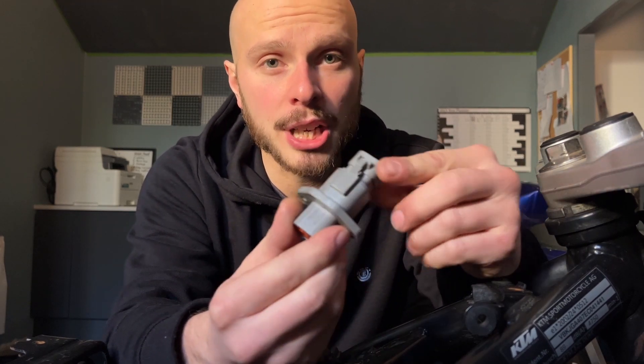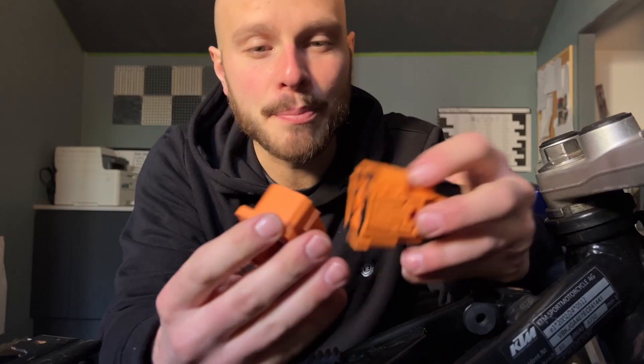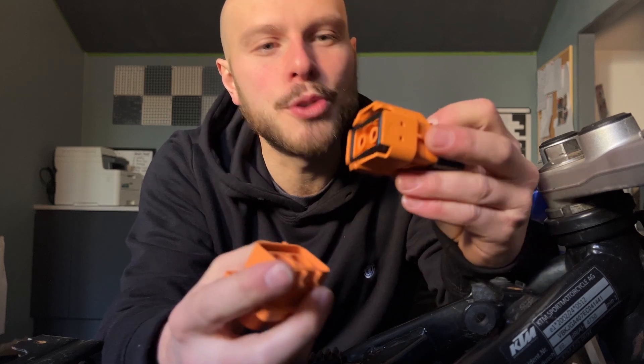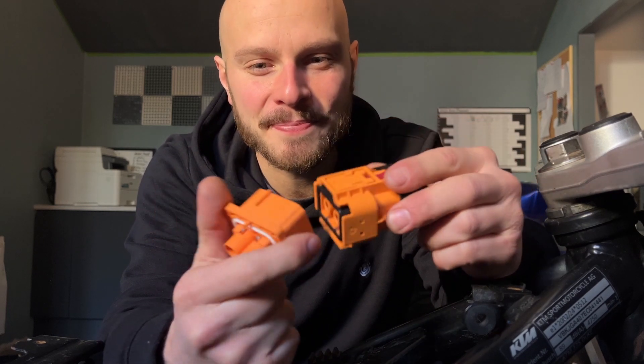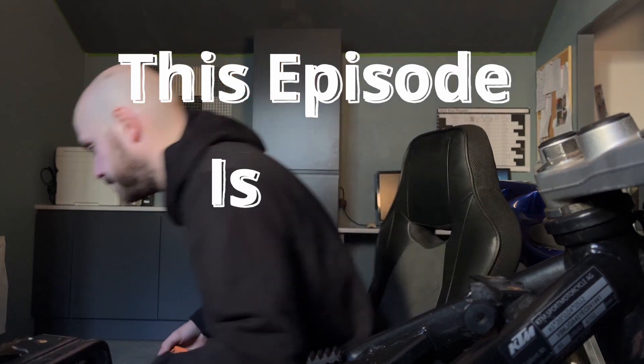Next up, I need to make the end for the box. This will be removable so if there are any repairs that need to be done I can do that. It's also going to house two multi-plugs: a large Deutsch connector for the charging circuit, and a proper electric vehicle Amphenol 120A connector for the main battery feed. I'm not certain how I'm going to make the end plate just yet — whether it'll be 3D printed or made out of aluminium. All I know is it's got to have a handle and it needs to protect the connectors so they don't get broken if they get knocked. But that's the job for next week. See you next week!